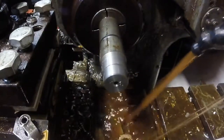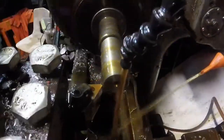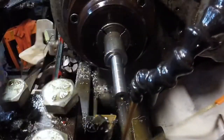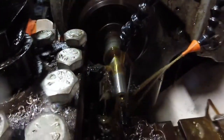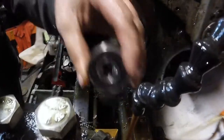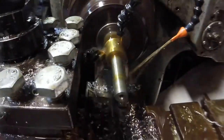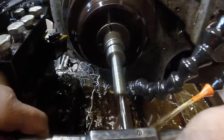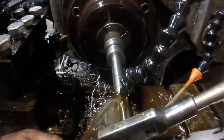So this is just some cold rolled steel here in the lathe. This part would ideally be turned between centers, but because I'm working on a turret lathe with not a very long bed, I thought what I'd do is go ahead and turn down one side, which is the shorter side — it's got a bit of a shoulder with a dimension to it — get that side turned and change the collet pads out to match that shoulder area being cut. Then once I flip it around, it can have that side in a collet and put the other side in a center. So instead of between two centers, it's between a collet and a center — it should be good enough.